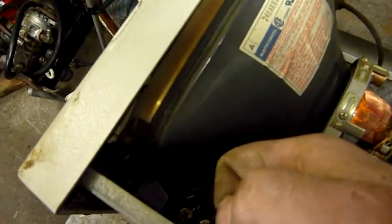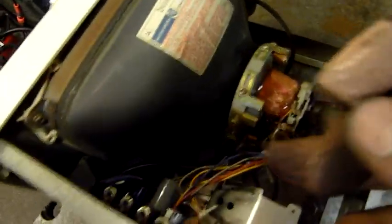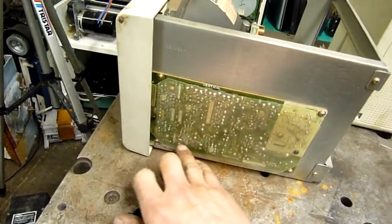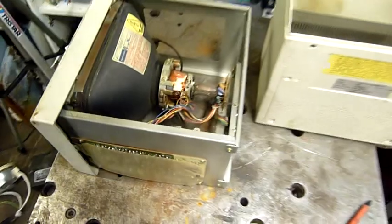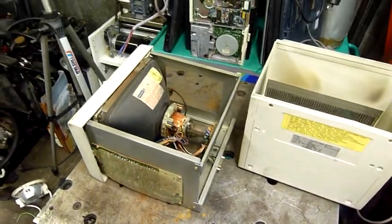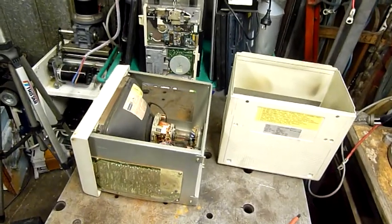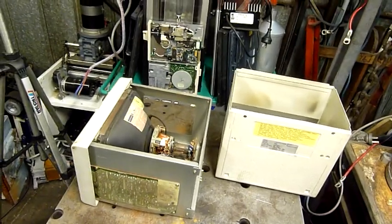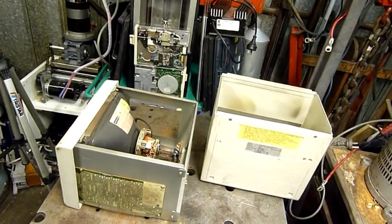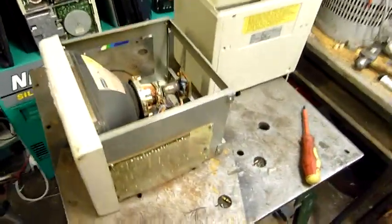The connector that comes in splits into two — there's an upper plug here which looks like it goes straight into signal processing, with vertical and horizontal control out here, and the lower plug is the one with the fuse and everything on it, so it's probably on/off signal and main DC input. There's no sign of rectifiers that I can see, so it'll be a direct DC supply from whatever unit it's supposed to be plugged into. It's not designed to take 120 or 240 volt AC input — just pure DC from a power supply. I'm going to grab an ATX power supply and go from there, but first I'll take this board off and examine it.